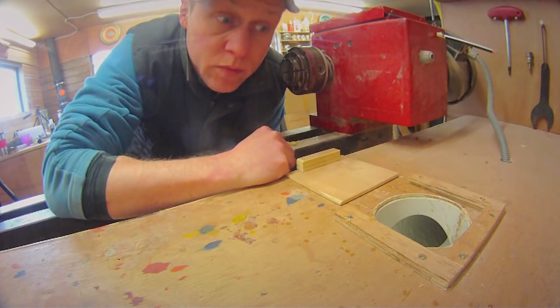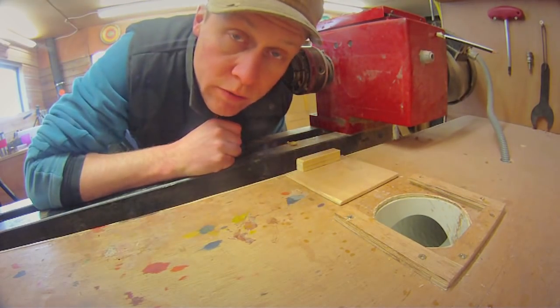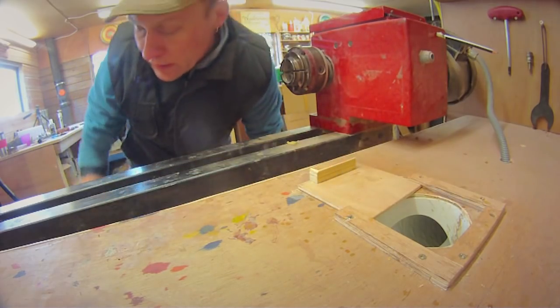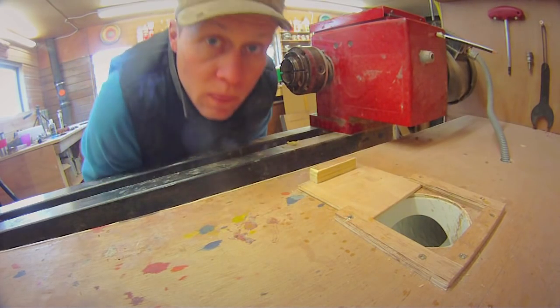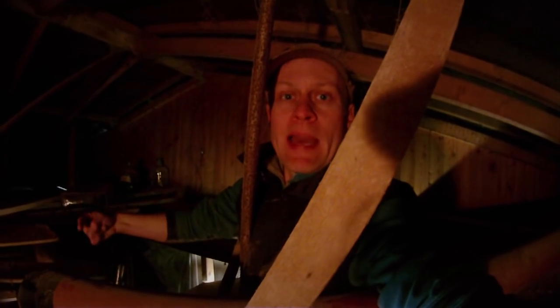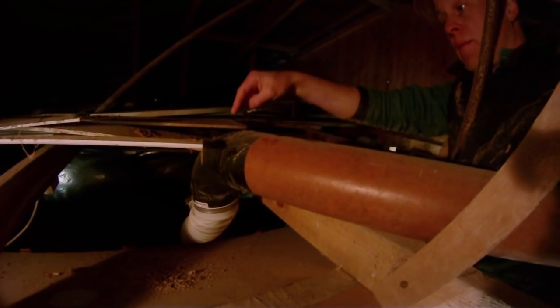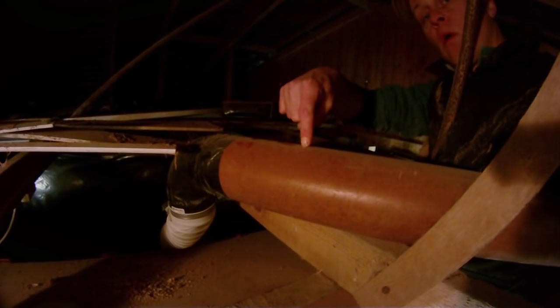This takes the vast majority of the dust away from the sanding on the main lathe. Then that goes down and then up and over the top. It also has a big dust hood that comes over the top and takes away the dust. Up in the roof, from the back of the main lathe the pipe comes up the back of the workbench where all the tools are and joins a 90-degree elbow joint, which then goes onto some four inch guttering downpipe. All of that goes down to the opposite corner over there, where it then begins its journey downwards again and outside to the extractor itself.